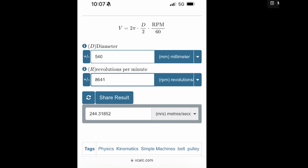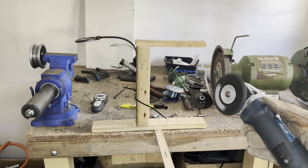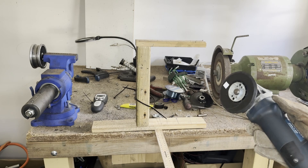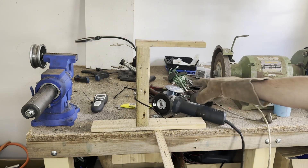But then we hit an issue. As I increased the length of the fishing wire, the angle grinder would actually speed up, but the length I measured would become shorter. When we slow down the footage, we can see why — the fishing wire tangles itself around the head of the angle grinder and shortens the length. So the fishing wire had issues. It was always wrapping around, and it was very difficult to keep it straight. That was becoming a problem, because I was getting high speed but not the required length to actually reach the sound barrier. It needed some more workshopping, so I ditched the fishing line.